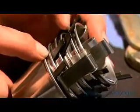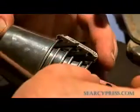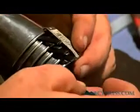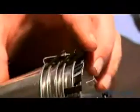Okay, now then. Now we're going to need a piece of metal to connect this cup here to the cup right below the top cup. This jumper will give us the negative plates we need that will produce the hydrogen oxygen gas in abundance. We add an extra insulator to give us a little bit more room to play with on this top connection, because we're going to grab the inside of the cup and not the outside lip. So we give ourselves a little greater margin for safety. We don't want to short out against any of these other cups.